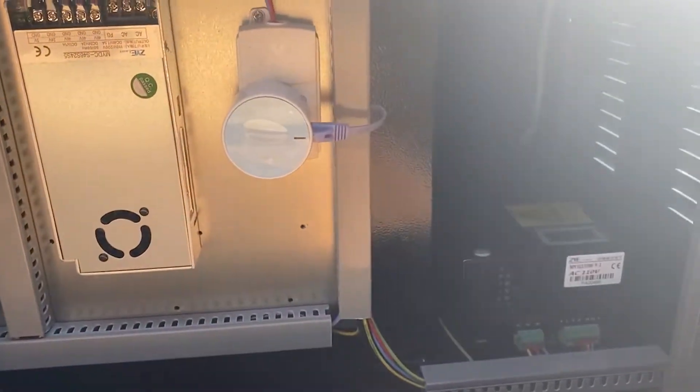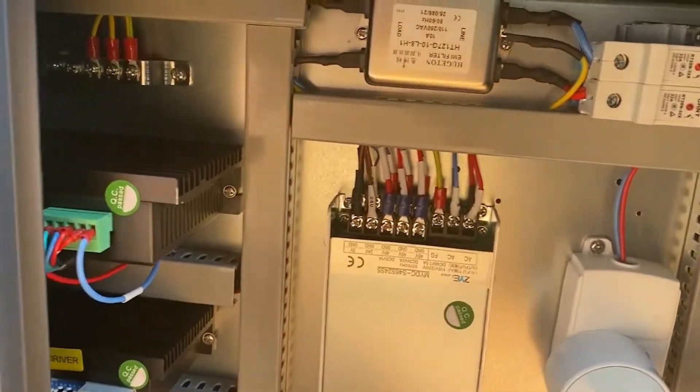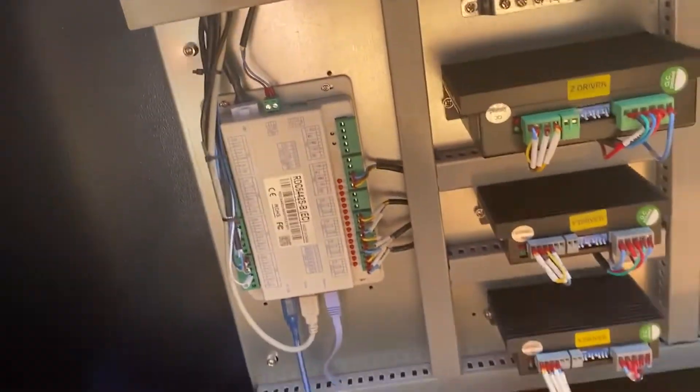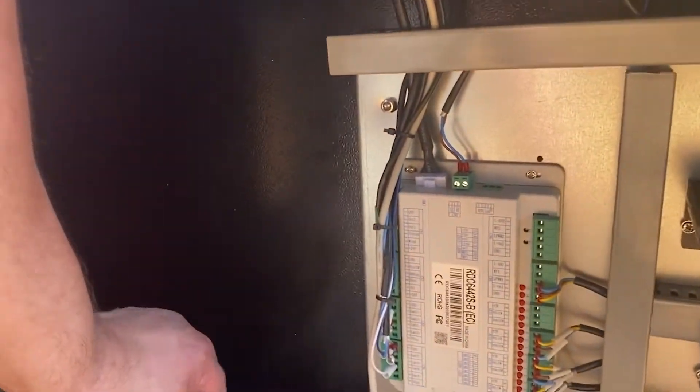In the middle there's the stepper power supply. The black and green is the drivers. The little midget fuse on the right — you need to make sure that you switch it out to a 15-amp time-delayed midget fuse. The guy that sold it to me told me to make sure I do that, because your laser just won't work otherwise. Make sure you change it to the 15-amp.